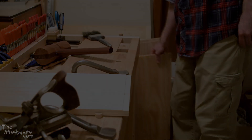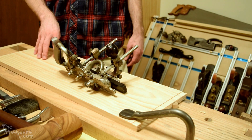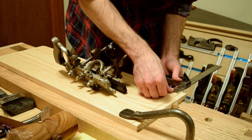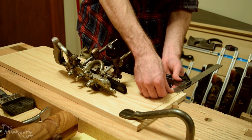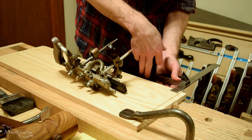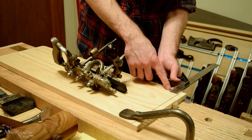There's one more thing I need to do before I get that far. The last thing I need to do — on all four pieces — is plow a groove for the plywood back. In this instance it needs to be about three-quarters of an inch; a little bit over is okay, under is less than ideal. Basically I need a three-quarters-of-an-inch gap between the back edge of the plywood and the back of the case. I have two marks here and I've set up my 45 for that.